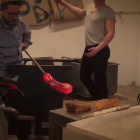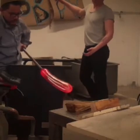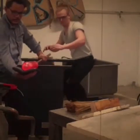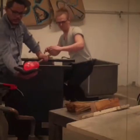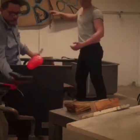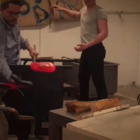So he's got the pipe on the rail, he's turning away from him, and then he flips his hand palm up and tucks it really, really far up underneath his armpit. That motion flips the tip of the glass to the other side of the pipe, so it goes from 9 o'clock to 3 o'clock. Then right as it's reaching the apex of that turn, he turns his hand palm down, coming out from underneath his armpit in a nice smooth motion like an airplane coming in for a landing to touch down on the rail. He's actually turning counterclockwise during that portion of the move, and it's that change in direction of turn combined with an adjustment of the pipe from being diagonal to being parallel on the rails right in front of him that flips that tip around to his side of the pipe.